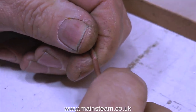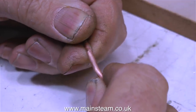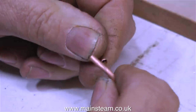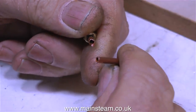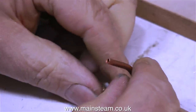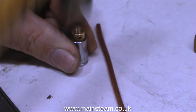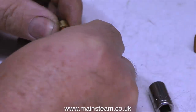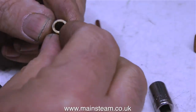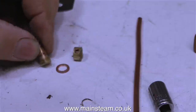This was the pressure gauge siphon I originally fitted to the boiler. When I fitted it, it seemed to twist round and it wasn't very strong — it's very, very thin-walled, far too thin in my opinion for a siphon, because a siphon often gets knocked. You knock the pressure gauge and it bends the siphon — a siphon like this would break too easily, so I'm going to change it. I'm knocking out the centre of the banjo union to show how it works. It's just a brass bush, and the centre part has a groove turned all the way round it with a parting tool. Then a hole has been drilled from the centre of the groove to the hollow centre of the bolt.